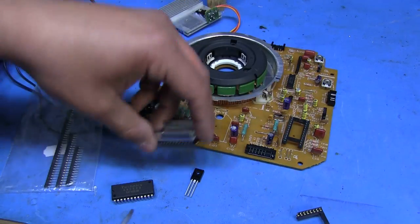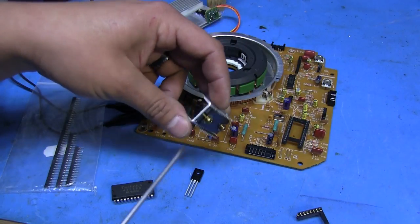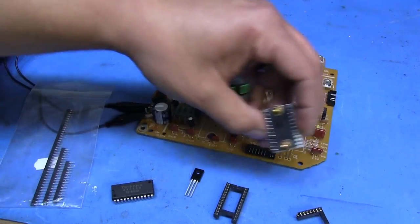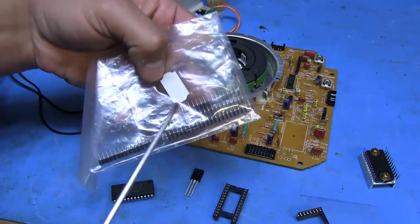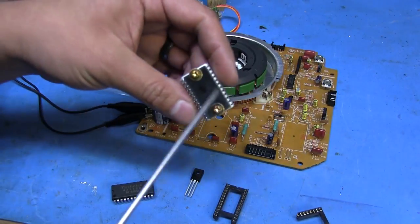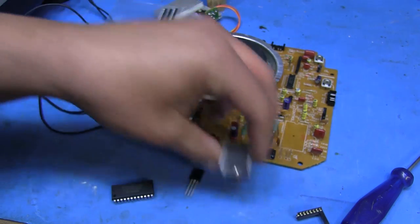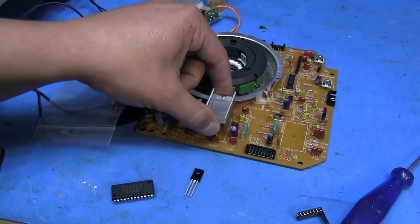For the power or motor controller, I was thinking to just solder it back onto the board, but if something ends up being wrong with this one too, I don't want it to be a hassle to remove it again. Because these sockets aren't wide enough for this chip, I can't use a socket - I'd have to use some machine pins. So I'm probably just going to break some of these off and stick them on there so I can remove it easily. Also, you can't use a socket because of the screws on the bottom - even if there was one wide enough, it would interfere.